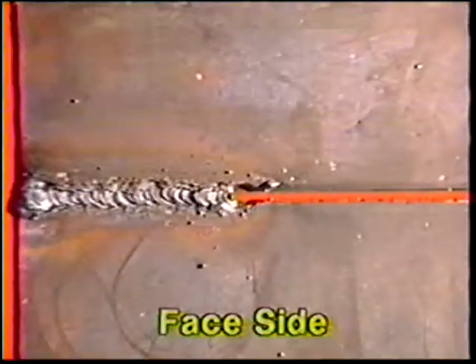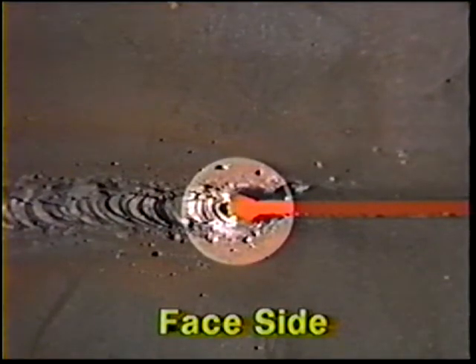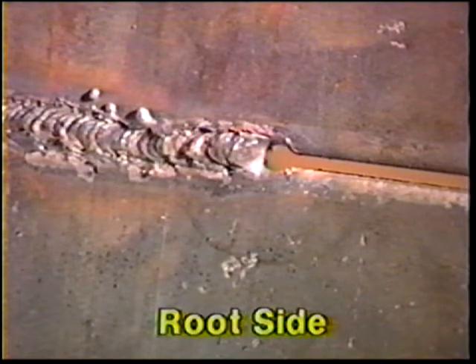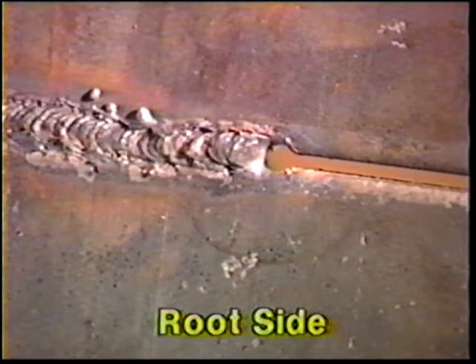The arc length will melt out a circular shape in the base metal, forming what is called a keyhole. The size of this keyhole will indicate proper root penetration — it should be about two diameters wide. Correct travel speed will keep this size constant by filling as you travel. Use a slight back-and-forth motion, staying within the keyhole, to help control the weld puddle and root penetration. Pause just long enough to fill the joint, then move the electrode again.